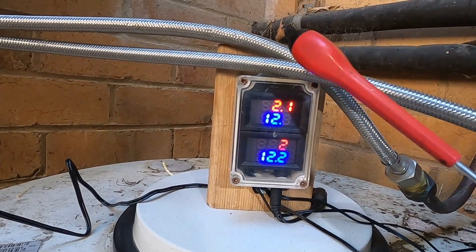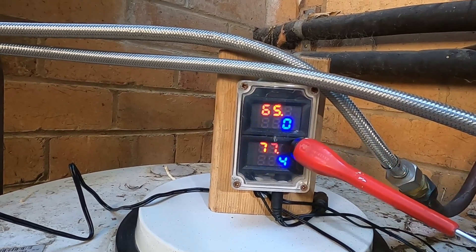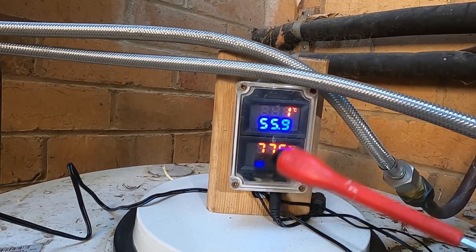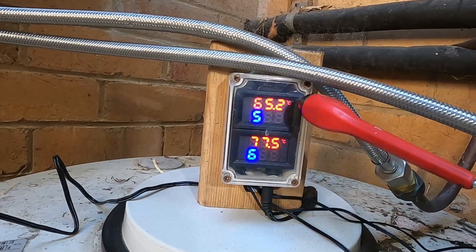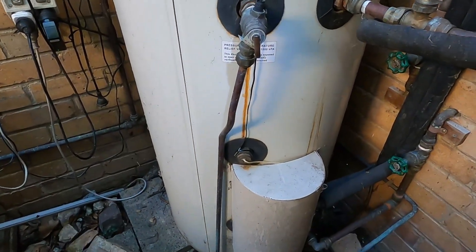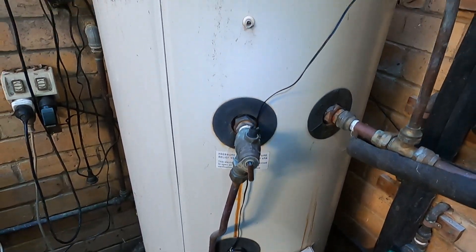Just a slight correction from the last video - I had the pipes slightly wrong. The temperature at the top pipe is coming off the roof at about 65 degrees currently, and the bottom pipe is going to the roof at about 56 degrees. The top of the tank is 77 degrees and the mid tank is 61 degrees. Cold water flows up to the roof, gets heated to 65, comes back and warms the bottom of the tank. On a really good day it'll go to 100 degrees. That's 200 liters of water heated from around 20 degrees up to about 80 degrees - a 60-degree rise - and I'll put the kilowatt energy gain calculation in the description.